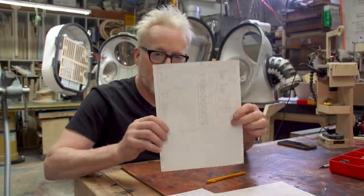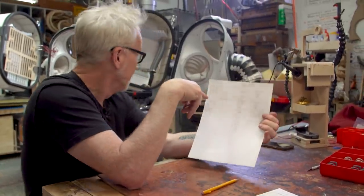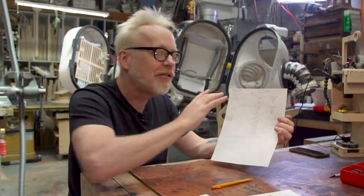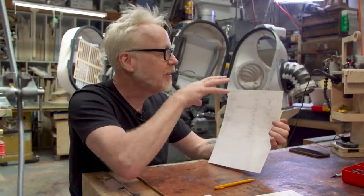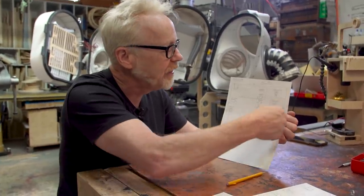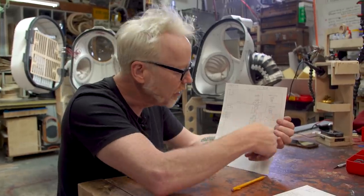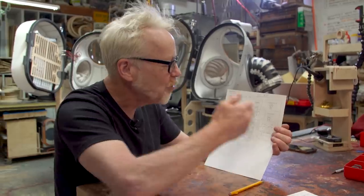The thing about a wiring diagram is that it is literally a construction diagram. Now that I have this, this is all I need to button in my system. And like I said, it's so relaxing to have drawn this out. And again, it took 3 tries. But it's so relaxing to draw this out and then look at this and know that all I need to do is like, okay, the visor light needs a lead coming off there to there. This one needs a lead coming off there to there. Like every lead's description is where I need it to be. And it's just plug and play.